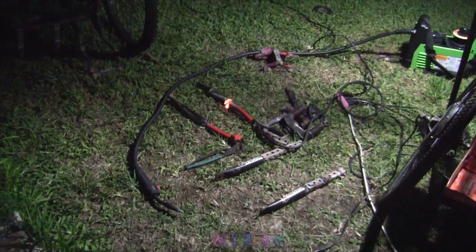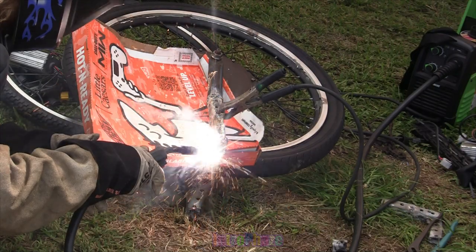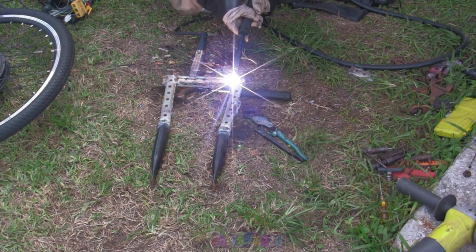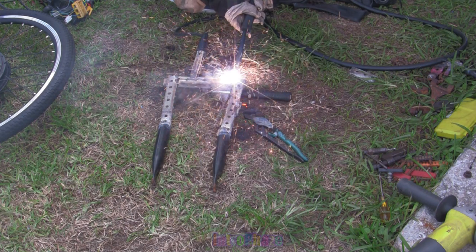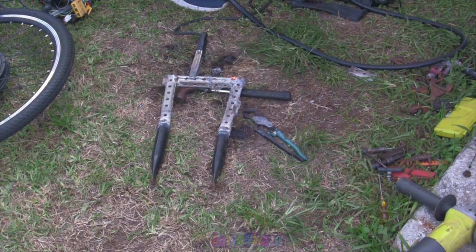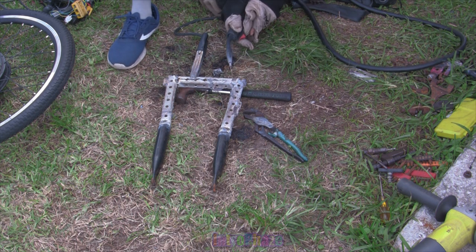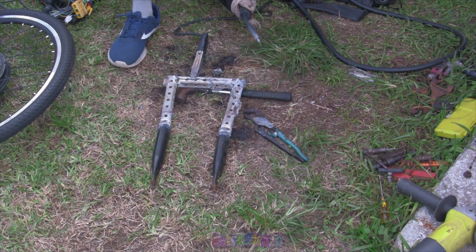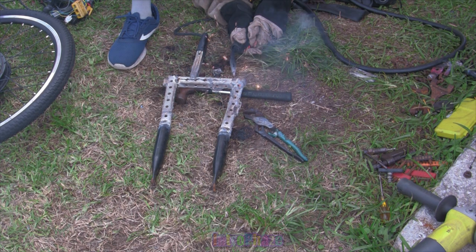I went through this for almost two years before I figured it out. You can't see the smoke in daytime video, but at night with a high-powered light it is unbelievable — the fumes cover about 15 feet all around you. That's why I recommend walking as far as possible away from your welding equipment, because the fumes still pour out even when you're done welding. And of course the heat from the steel or aluminum continues releasing fumes that are horrible for your health.